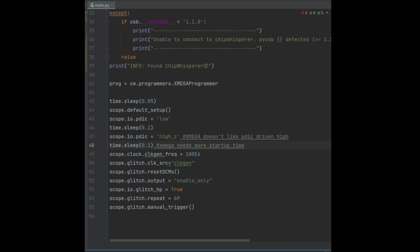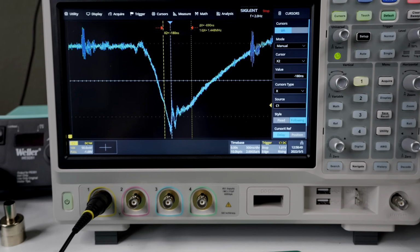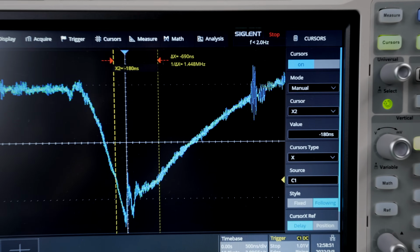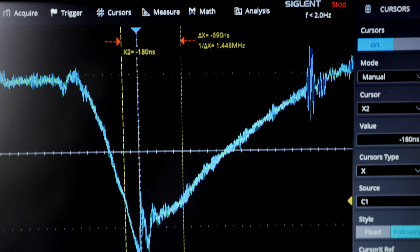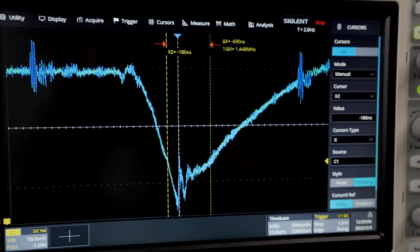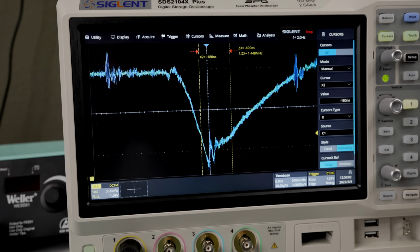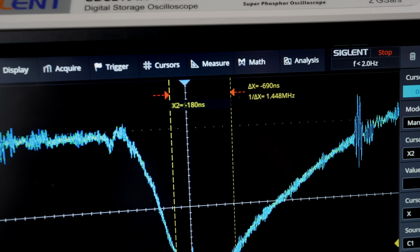supply to ground. Now normally when we think of something shorting out, it involves sparks, and it might not work afterwards. But in the case of the glitcher, the length of time we short the power supply out is so incredibly small that the voltage doesn't even fall to zero. Due to glitch timing, length of wires involved, and capacitance on the circuit board, the voltage just dips down into the unpredictable region the datasheet told us about.